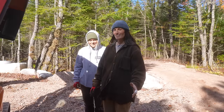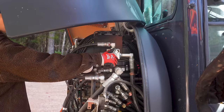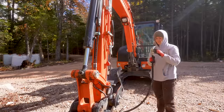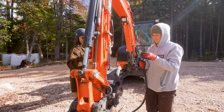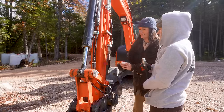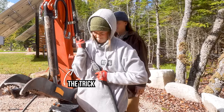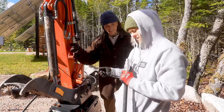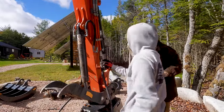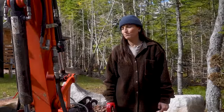If you guessed compactor, you're right — we're using the compactor! Because we're using the compactor we need to change the valve. Let's attach those hydraulic lines. We went back to our notes — aka videos — for some tricks. We learned that connecting these hydraulic lines is a two-person kind of gig. It all depends on how lined up things are, and it requires that extra push at the end — you think it's in but it really has to be pushed up to release and move.